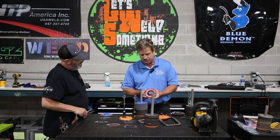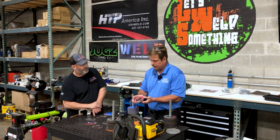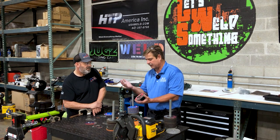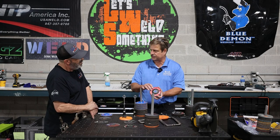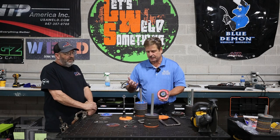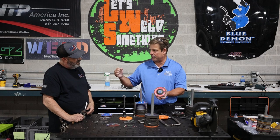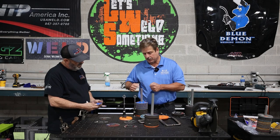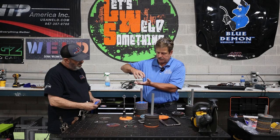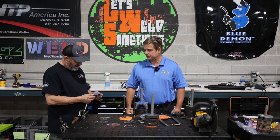This is an Ovation wheel — you can tell it's got a double density to it. But it's not just about the grit; it's also what the bond of the paper is. For example, if you have a cloth cotton sandpaper you don't want to put as much pressure on it as you would with a polyester-backed one. With a polyester backing on a coated abrasive, you can put a lot more pressure — the heat from the pressure will actually melt the back and expose more abrasive. With a cotton one it would just melt and go away.